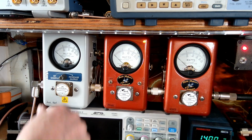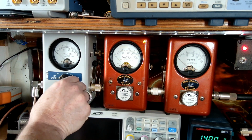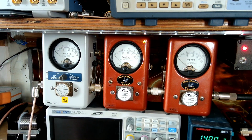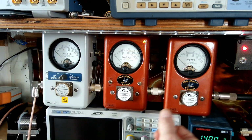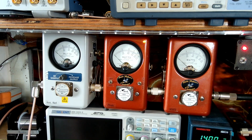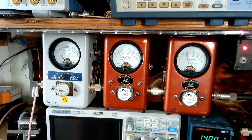Go back to the AM. Well, we can turn our 5-watt slug around, because it's easier to show you as far as on low dead key on a 5-watt slug than it is on a 50 and a 100. So all the way up on the 50-watt scale, we've got approximately 9-watt dead key. So we've got from 1 to 9. So great range as far as on the AM side.